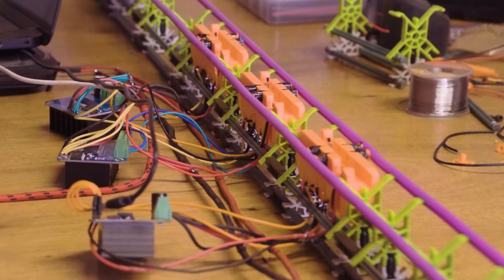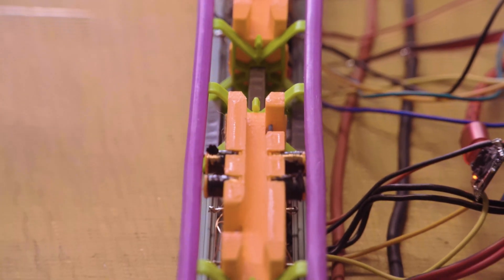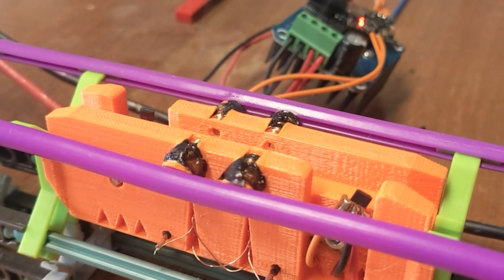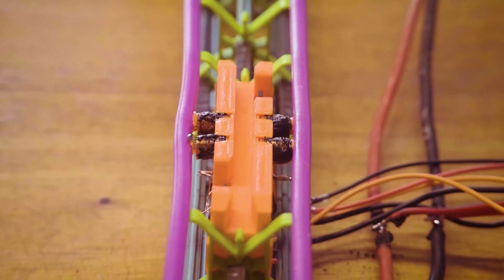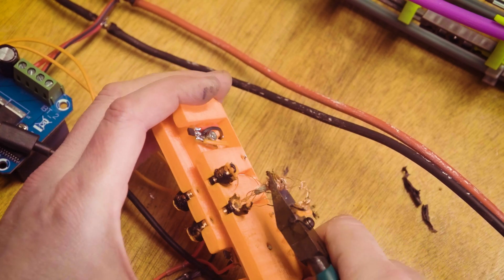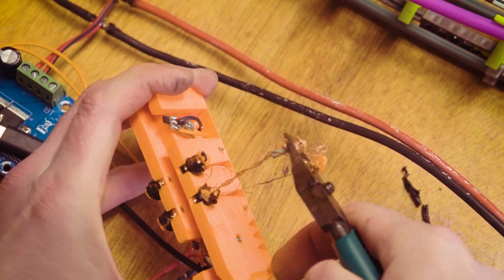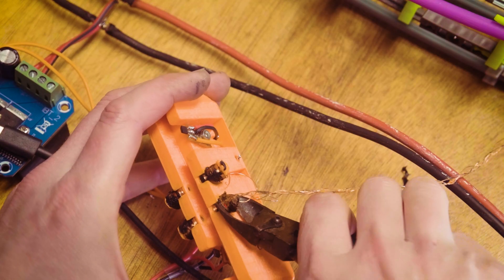So logically I tried a third motor, but that's when this project really started to go off the rails. I was exceeding the capacity of my power supply, so I tried powering the roller coaster from the 24-volt battery bank that normally powers my home. In an off-screen test of this setup, the roller coaster launched, but the H-bridge power supplies failed to shut off and destroyed both themselves and my motors. I started this project over three months ago. Each one of these motors takes over a day to build and test, and the tiniest mistakes are punishing.